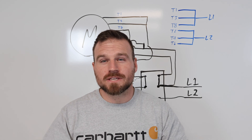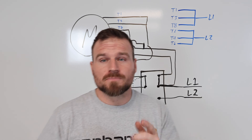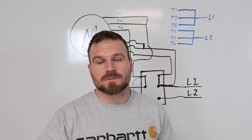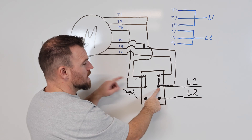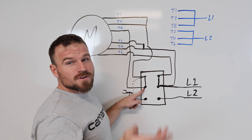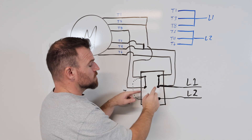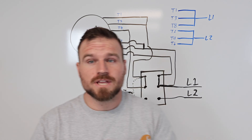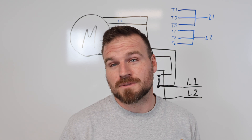As a final reminder, because I really want to help you wire whatever motor you might have — I had a six-lead, and I hope to cover a nine-lead soon — it's really about how this switch works. Once you understand the switch, you can take any motor, any wiring diagram, and manipulate it to get the switch to work. You have your bundle of wires going to one terminal, the other bundle going to the other terminal, and the two wires that need to be switched — on mine it's T6 and T8, though on another motor I was working with it was T5 and T8. Once you understand that, you're golden. I hope you enjoyed this video, and if you have anything you'd like me to know or something I did wrong, please leave a comment.